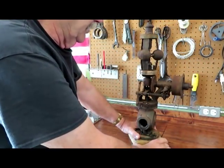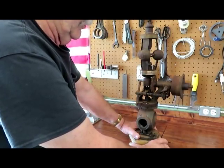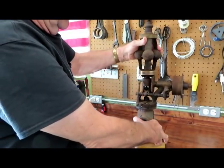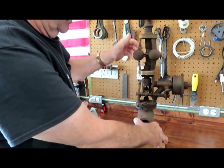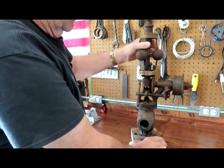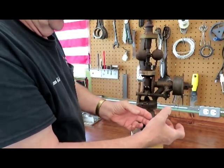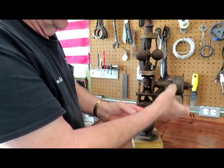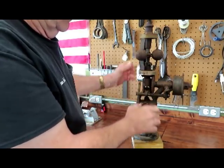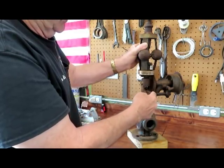I did one two years ago, very similar to this, in video number 20. And you can check it if you'd like to go back and look. This governor has got a few things different about it. It doesn't have the automatic stop deal with the weighted idler, and it's got a worm screw type adjustment on this spring here.